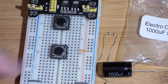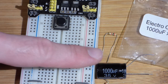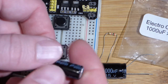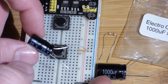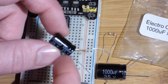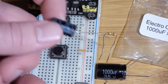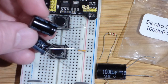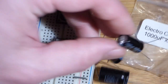In this video we're going to do a step-by-step build of a couple of demonstration circuits where we look at these 1,000 microfarad capacitors. They're somewhat large value capacitors for regular capacitors, but they're not supercapacitors. I got one here rated for 35 volts, and then these two that came out of the package are rated for 25 volts. They behave exactly the same — the only difference is you can charge the 35V one to a higher voltage. We're only going to be using 5 volts anyway, so it doesn't matter for this circuit.